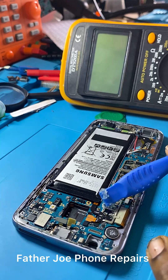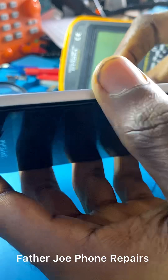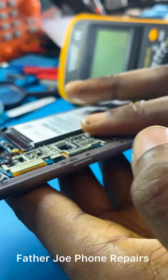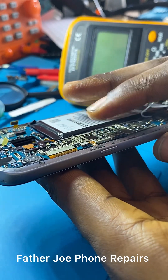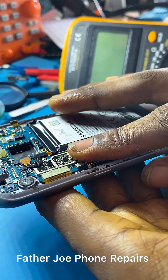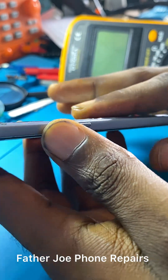I need to check deeply to know the main reason why. It could be something else — it could be an EMC or any other IC. According to the reading, the power is still working well, but something somewhere is consuming power and that is why the power IC is heating up. I need to trace and find where the problem is coming from.